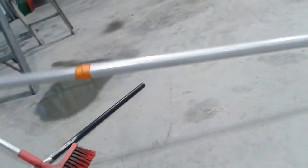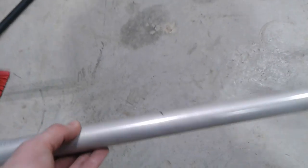This is empty - now we have the sleeve in the middle of the 12-foot pole, and we have the center marked. We know where we're starting and where we're ending, and we've plugged the ends and filled it with sand. That's going to help it not want to compress. Basically at this point I'm just waiting for more muscles because I can't bend it. I had a hard time bending the empty aluminum - there's no way I'm bending two plus sand inside. So hopefully Dave's on his way and Dave's going to help us.